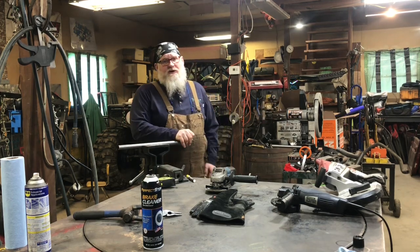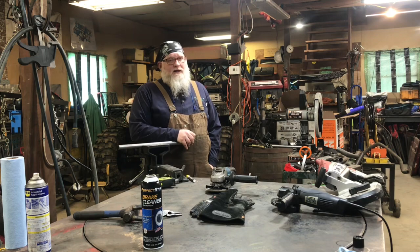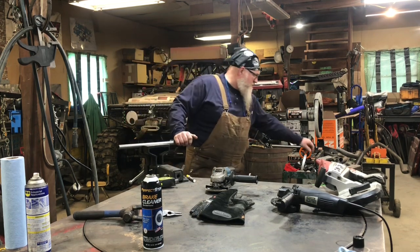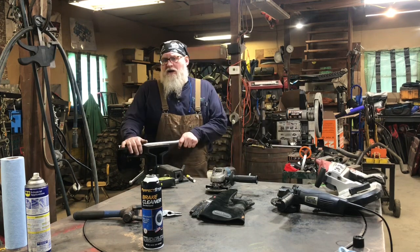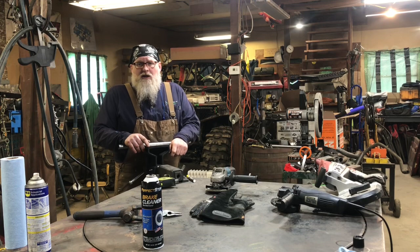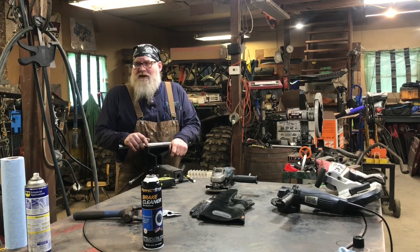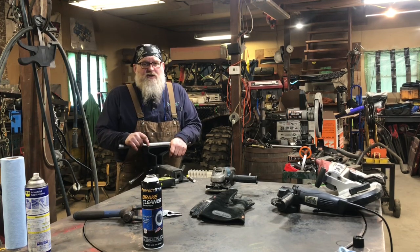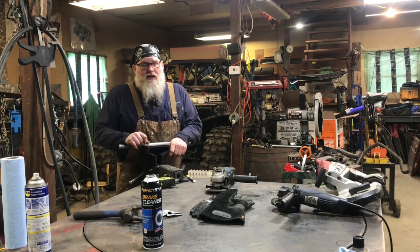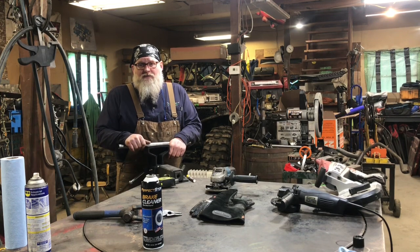If you've never tried one, they're worth getting. Way less mess, no dust. It just rips what almost looks like drill shavings out of the metal, and it leaves a really nice end on it. The blades are a bit pricey, but in all the years I've been using it, I've only gone through 3 blades, and Harbor Freight actually sells the blades now, and I gotta tell you, their metal blade works.